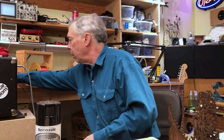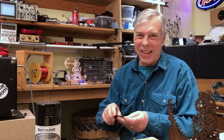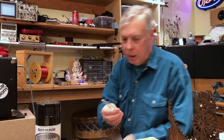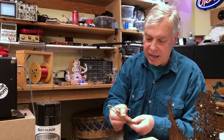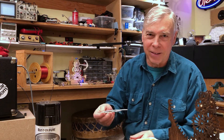What I've got is a copper wire coil — just heavy ground wire copper — and that's the cathode. The plate is attached to the positive of the supply. In this case I've got a basic little lab power supply that I can adjust and control for either voltage or current. The backside — you can see it left quite a mark — but I don't care. I used this heavy gauge aluminum wire that was actually part of an old satellite dish ground wire, affixed to the back with electrical tape. That gave enough contact, and the aluminum won't enter into the electro etch process — it doesn't erode or get plated.